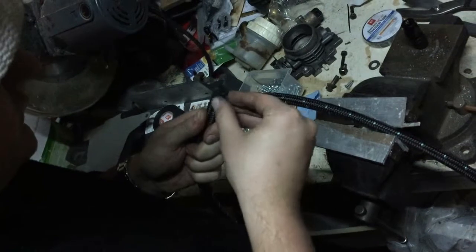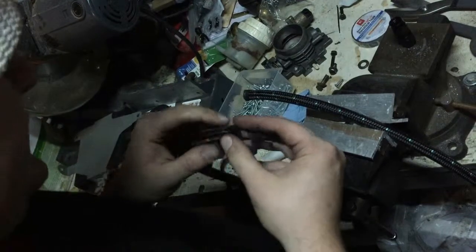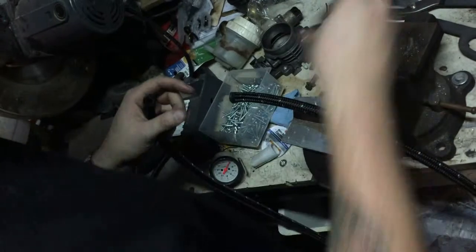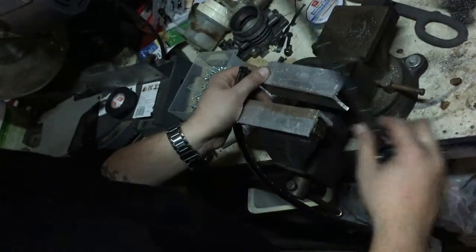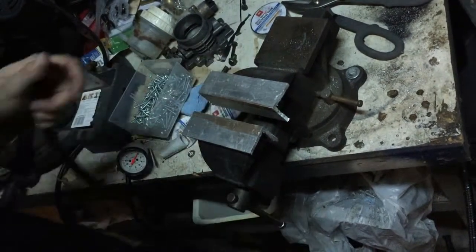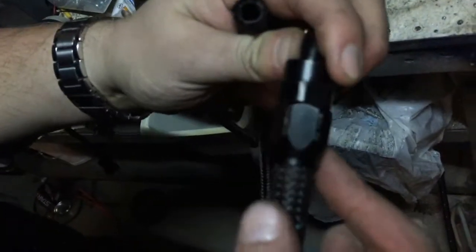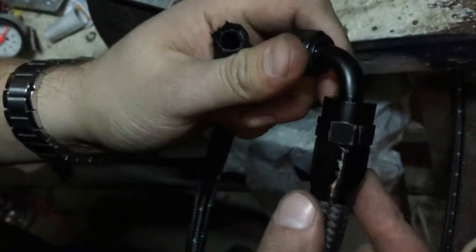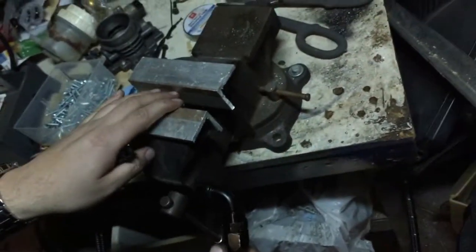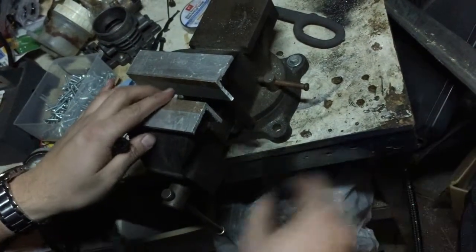You might notice the angled aluminum that I have sitting inside the bench vise in the background — that is to help keep the fitting from getting scratched up and banged up during the install. Normally you would just use aluminum jaws that you could purchase ahead of time. Unfortunately I forgot to order those, so I made do with these, which is a slightly more expensive way. This is just showing some markers that happened from using a regular wrench on the other side. If you purchase an aluminum wrench ahead of time, that will prevent that kind of damage.